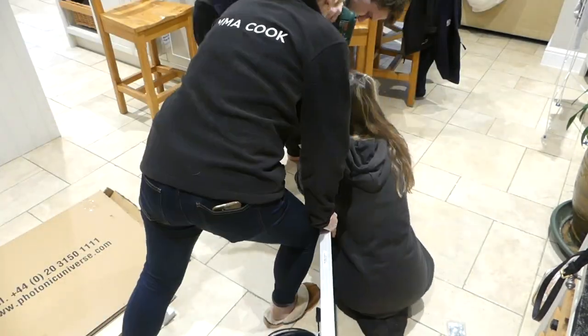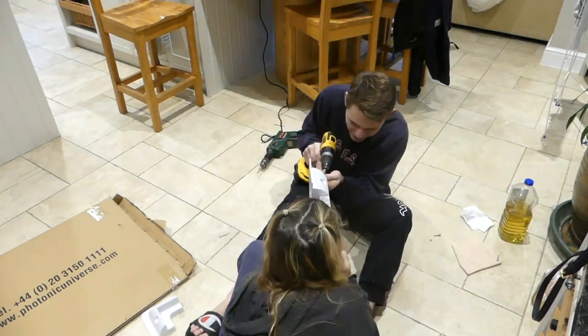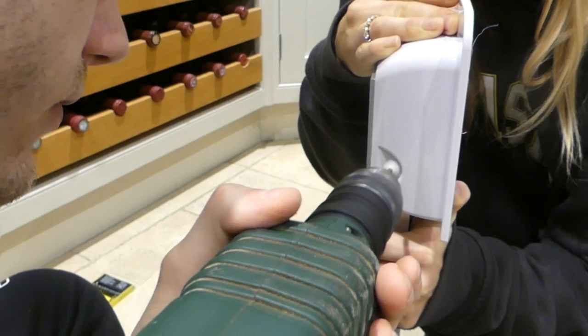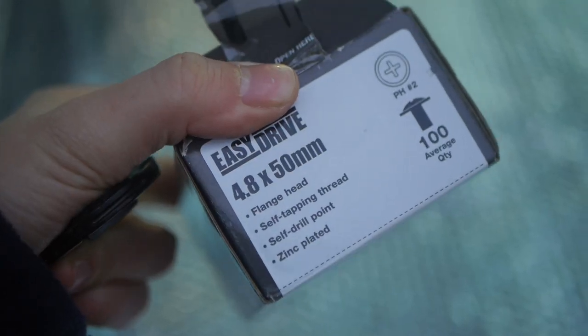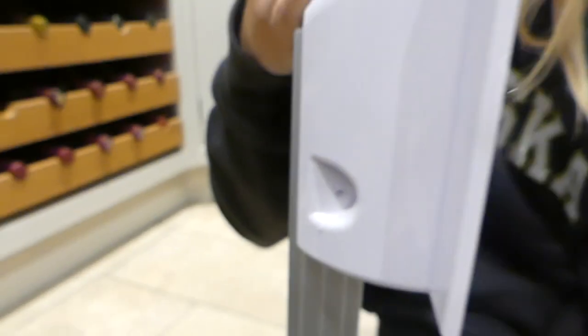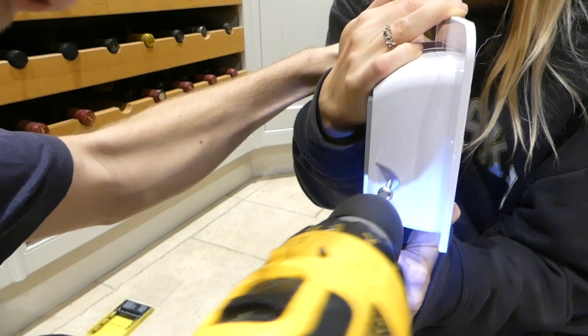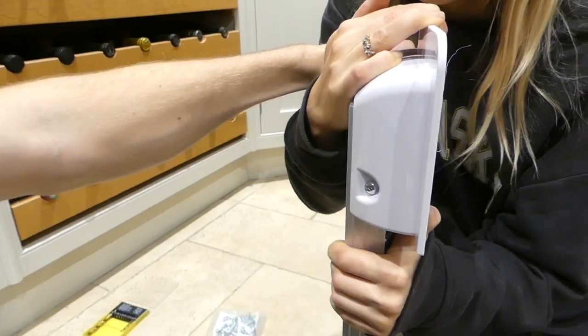Then it was time to attach the ABS plastic solar panel brackets to our solar panels — we've linked the exact ones we used in the PDF file in the description. Originally we were going to screw them on with nuts and bolts from Screwfix, but the nut was too thick for the drill bit we had. So in the end we used our trusty easy drive screws. For each bracket we drilled into the plastic whilst it was on the solar panel to create an indentation to align the easy drive screw, then simply screwed the easy drives all the way through the plastic and metal.